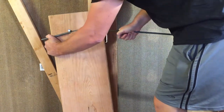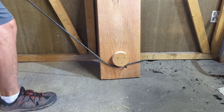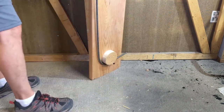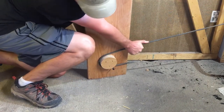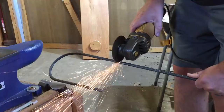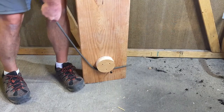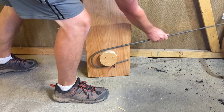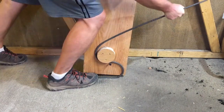When it comes to actually bending the rebar, the longer the piece you're using the more leverage you're going to get and the easier it is to bend. But you also have to be careful because rebar has a tendency to find a weak spot and kind of kink there. So you have to be a little bit deliberate about forcing the rebar around that circle. I started with the U, then trimmed it to the length I wanted, and I figured I could use the same radius for the S. Once you get the basic curves in, you can adjust by hand or with a hammer to tweak things and make it look right.